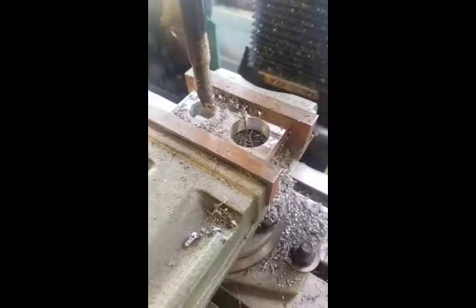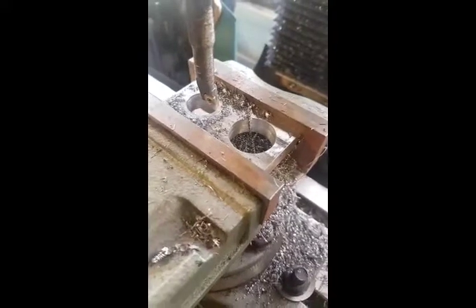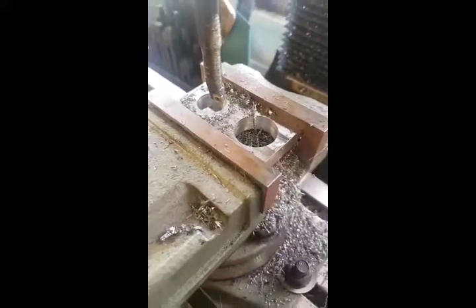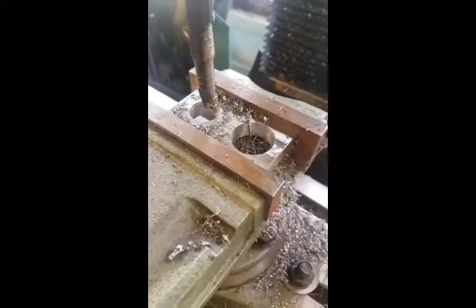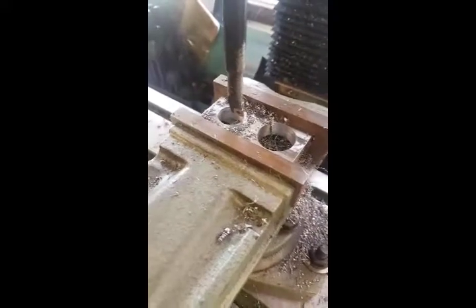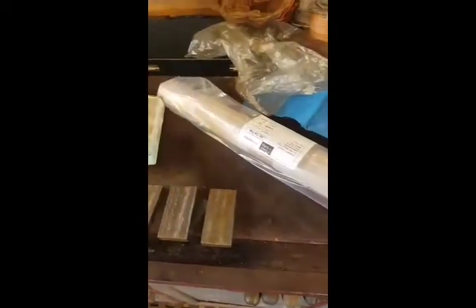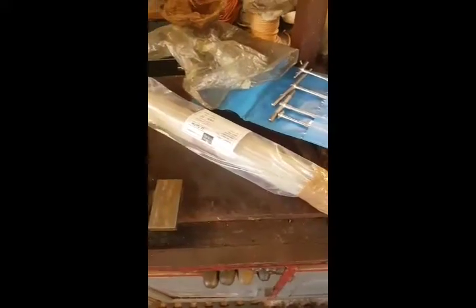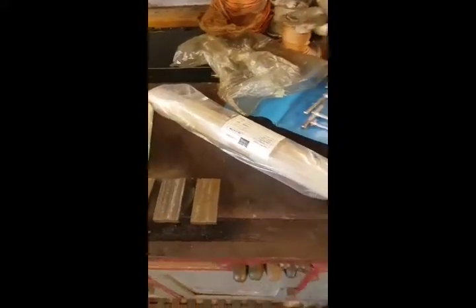The fourth one I'm currently boring — I know I'm boring, but I'm also boring these webs out. They're bored out to 1 and 1/32" to take the actual shaft that will go through them. I'm going to make it up out of three different pieces and hopefully use Loctite to put it all together. I've got the actual shaft there — that's a piece of 30mm EN8 — so there'll be a bit of turning on that.